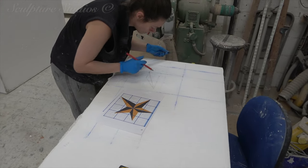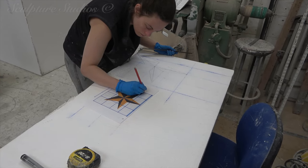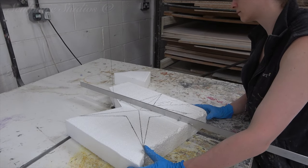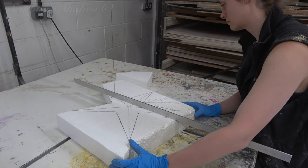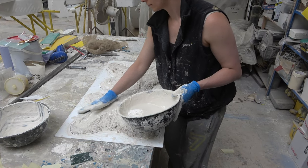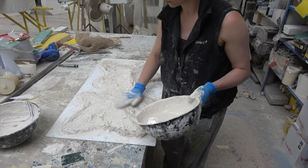Work is now being started on the Lasallian star, which is being cut and carved from polystyrene, having a quick plaster mould taken in two parts and a glass fibre cast created. We're adding a little metalwork to the top of the sculpture so that this is installed nice and secure. The cutout section then needs to be re-laminated back into the main form and made good before painting.